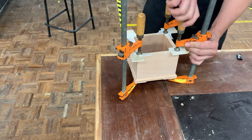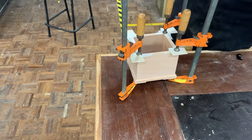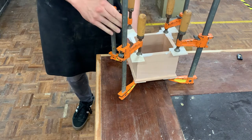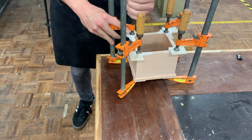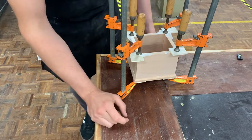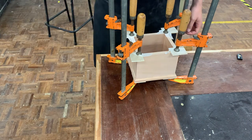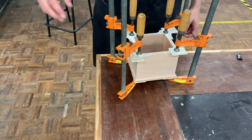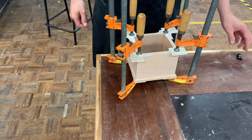Bring that down and set. With those packer pieces — as you saw, I taped them on, and the reason we tape them on is so we're not having to deal with so much of an issue at one go. Get that fourth clamp on. Check alignment, check all that alignment, and then using the wet paper towel go through and remove all that excess. Get the wet paper towel to remove all the excess, then get the dry paper towel and remove the wetness.